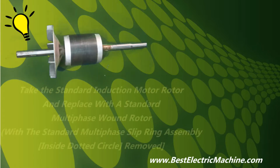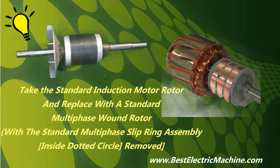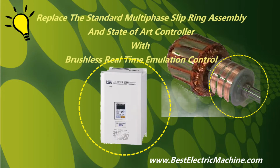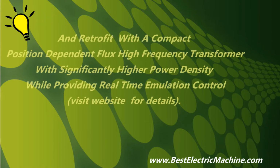Simply retrofit the passive rotor element, such as the squirrel cage winding set of the standard induction electric motor, with a similar active balanced multiphase AC winding set as the stator, and replace the traditional multiphase slip ring assembly and state-of-art electronic controller, such as any derivative of field-oriented control, with a brushless real-time emulation controller to sensorlessly and automatically assure synchronized speed and position, frequency and phase.